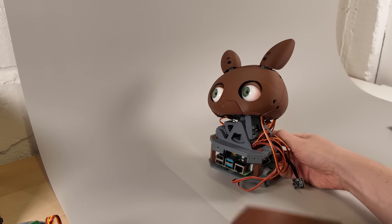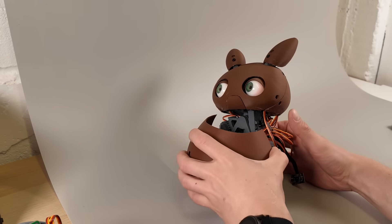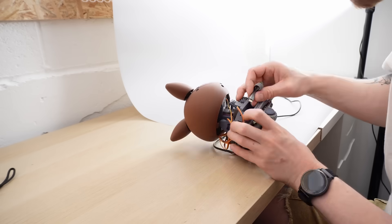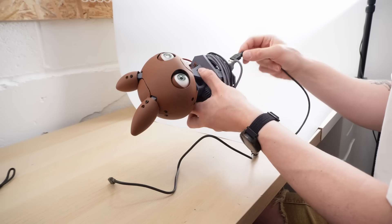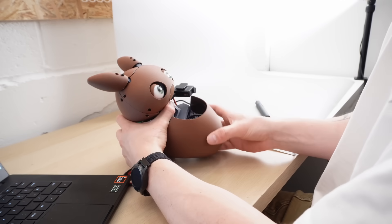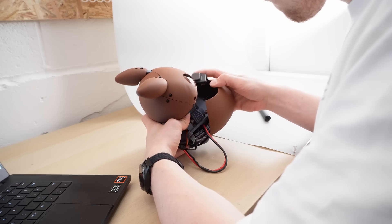Coglet, ask me a question. The robot responded: what is the best way to get a job in New York City? Just to prove that I could, even though the project is in quite an early stage of development, I ran everything locally and simultaneously using a battery — so that's the Raspberry Pi coordinating all of the AI responses, camera face tracking and all of the movement control. I had to fatten Coglet up a bit to fit the Raspberry Pi in the base, and then I completely forgot to leave space for the USB cables, so I had to make it even bigger, and since I didn't have time to buy shorter cables or figure out any of the placement for something I'd be changing later anyway, I just let the remaining cables hang out the back. This is just a proof of concept after all. I also had to lobotomise Coglet in order to get the AI model to respond at a reasonable speed on the Raspberry Pi, so I switched from the Flan T5 large model to the Flan T5 small model, which significantly degraded the quality of the responses.